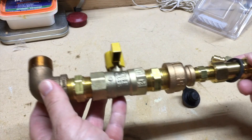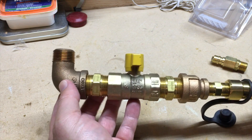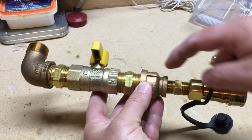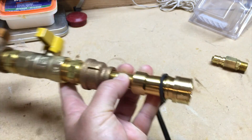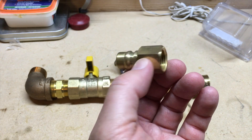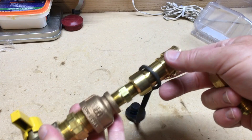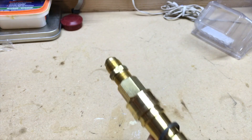Let's go ahead and take a look at all the connections. I have one long pipe with lots of adapters. I have a 90-degree street elbow — male to female — a coupler, a three-quarter inch gas shut-off, another coupler, a three-quarter inch reducer to three-eighths coupler, and my quick connect fitting. Here's the other end of the quick connect which attaches to the hose going out to the propane cylinder. I have an adapter going from three-eighths to a three-eighths male flare, and the hose is three-eighths female flare. To connect the two, all you do is pull down, insert, and let go.